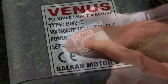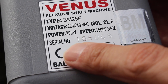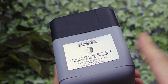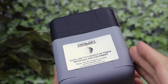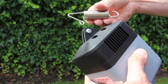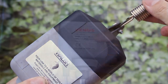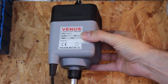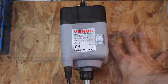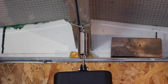This is the motor — this is a UK model, so it's 220 volts, 200 watts, and it will run at up to 15,000 RPM. This model has a tough ABS housing which helps to minimize weight and also minimize cost. On the top there is a spring used to hang the motor — hence the term pendant drill. The spring allows the motor to move around a little and also helps to prevent vibration and noise.